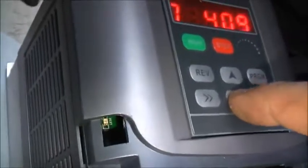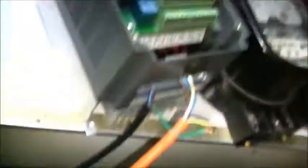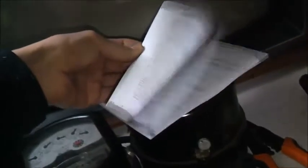I've definitely got this one in Delta. It's not the motor - the motor's fine. I've got to tell it how much time and current to give it. This is my first VFD by the way - I've just got to learn now. How do I tell it to give the motor some oomph? That's not the torque it's got at the moment. It's giving it the frequency and the motor is turning, but I think I've got to tell it how much current to give the motor to give it some torque - something usable. I've got to program this thing.